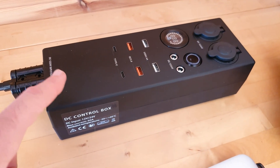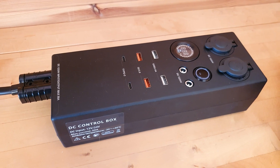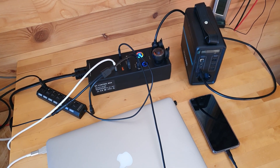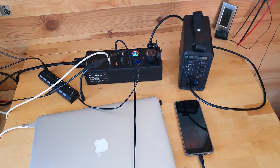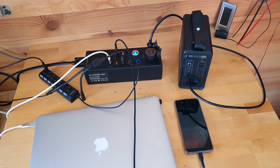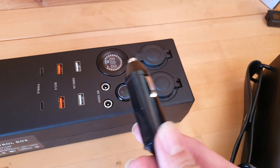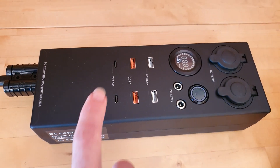There are blade fuses inside. I wrote an email to an associate at Licity and they confirmed there are two blade fuses inside — likely in both models, but definitely in the larger unit — to protect the system. USB ports and DC barrel plugs don't use much amperage, but when charging something using 60 to 80 watts through the car plugs at higher amperage, you'll want to think about fuses. Car plugs usually have fuses built in, going up to around 10 amps. One teardown showed a 50-amp blade fuse in the unit. The USB ports are also protected by special inboard chips.